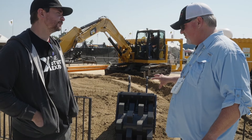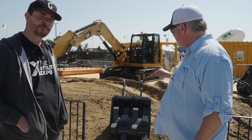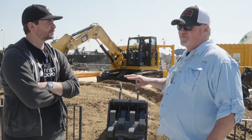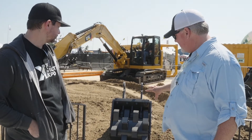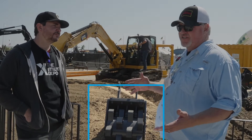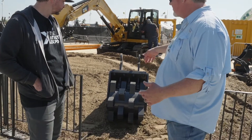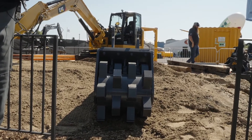This is our Felco wheel compactor. This is a 24-inch wide version. It's designed for basically backfilling or compacting most soils — clay-based soils. The design and the pads on there work to knead the soils into what you need to hit compaction in the 90 percentile range. And then we've got the scraper systems in there to clear the material as it goes through the wheel so it doesn't bind up the wheel.